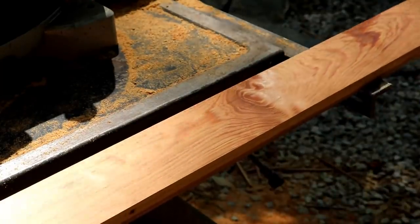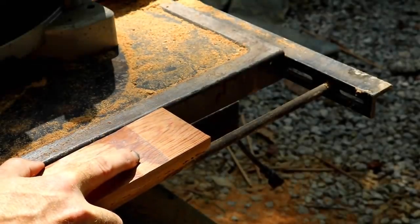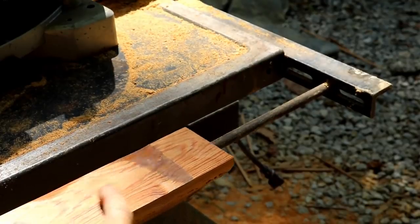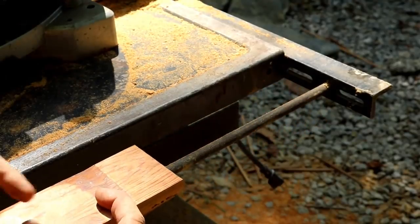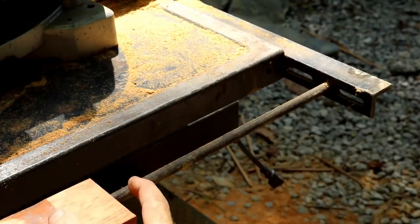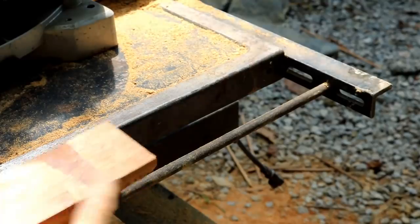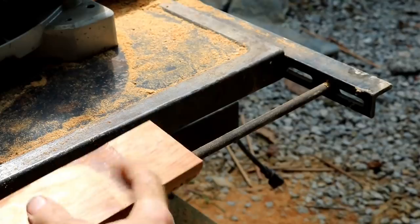So man, that's a really nice piece of wood. It's got some planer snipe on it from when it was originally planed. If you don't know what that is, a planer, this one anyway, and most of them, have two rubber rollers, powered ones that pull the wood through the planer. And in between those rollers, it has the knife head. Once this board comes off of one of those rollers at the end, it can tilt up and get into the knife head a little deeper than it does everywhere else. So you can avoid it somewhat, but yeah, that's pretty bad right there, really.